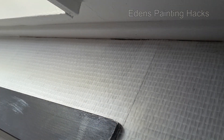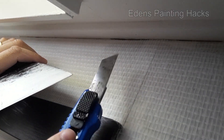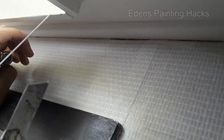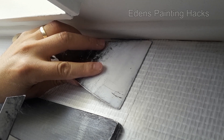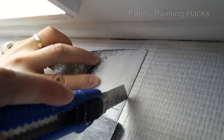Now these two pieces are overlapped. You'll notice that the edge has become thicker. Now you can cut. With a uniform pattern, it doesn't matter where you cut. But with this pattern, I find a fiber line and cut right along there. Press your knife through the wallpaper firmly, so you cut both pieces at once.